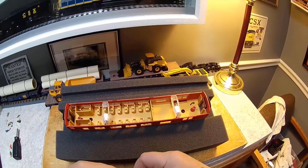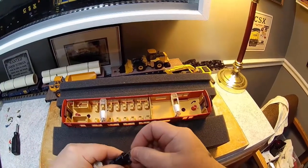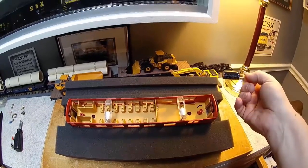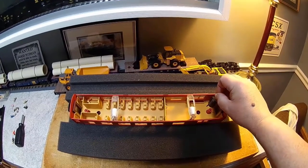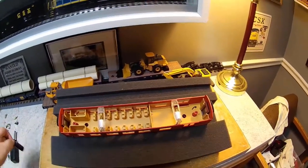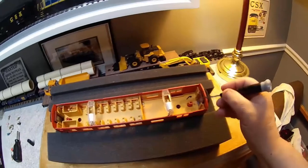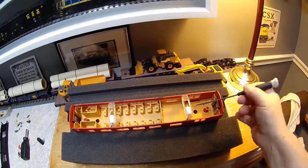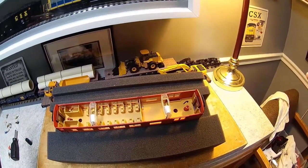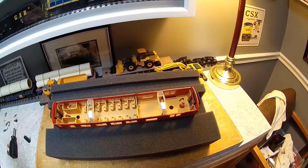Once I've rectified the voltage to DC, I need some way to store it. I'm going to use capacitors — specifically some very large-storage 6800 microfarad capacitors that are small in size. It looks like I can fit one right here and one right down here. That should be plenty of storage for flicker-free lighting since they only go out for a fraction of a second. There's plenty of space to hide components on the floor.